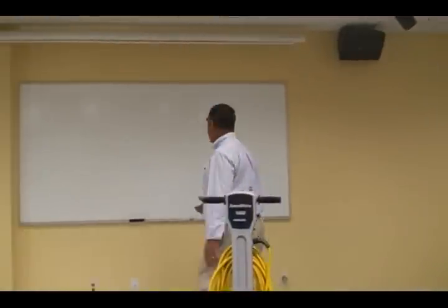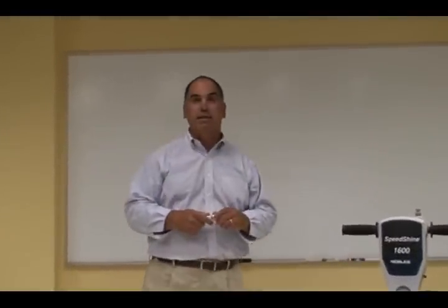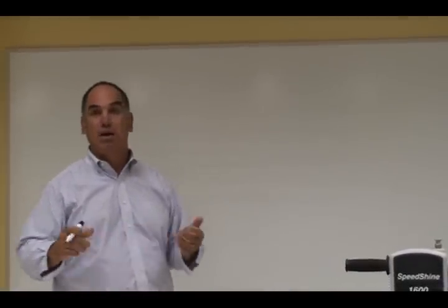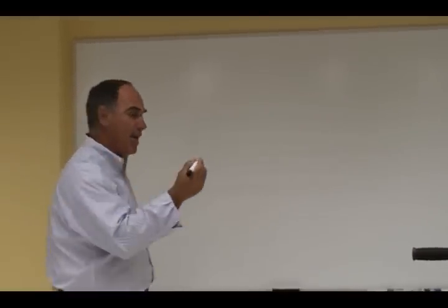And I want you to remember something. Spray buffing was invented by a custodian. Basically, he took some turpentine and some floor finish and mixed them together. Now you and I know we would never mix chemicals, it's not safe. But the idea was that the turpentine would get the dirt off the floor and the wax would bring up a gloss. There's some problems with spray buffing, but it's still used widely throughout the country to bring up a gloss on the floor. Machines and speeds is the important thing to understand.